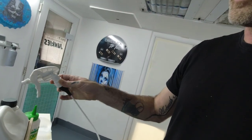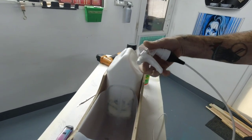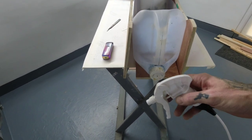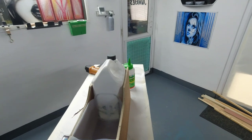You'll have this pump sprayer so you can pump out of there and just squirt through your gun and clean the front of your gun - that'll be fresh gun wash. This one will be your soaking gun wash. I've left it so we can slide this out; if I need to empty it I can just undo this and empty the dirty stuff out. I'm going to put a filter in the end of this cap so I can filter through and reuse it. Nice simple box - just a jigsaw and nine mil piece of offcut ply to make a box.